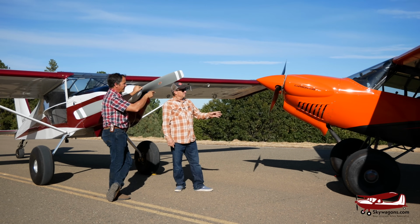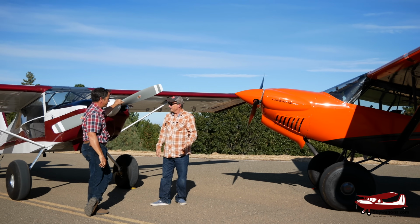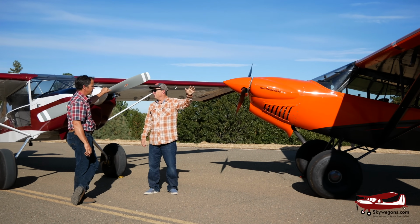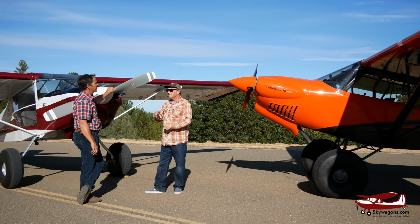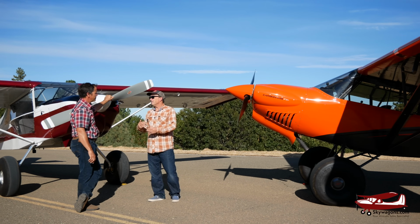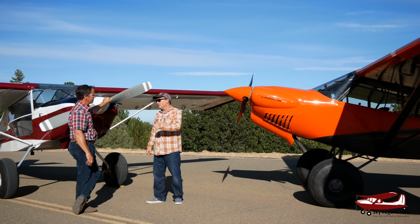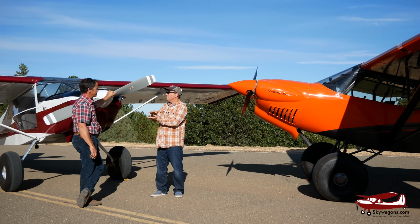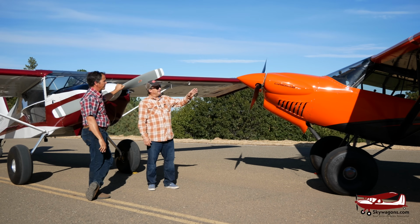Fabric, carbon fiber. Now this FX3, you go to the factory a couple of times and you help them. You're there day one when the customer cuts the fabric and the carbon fiber. You're there the whole week going from station to station, cutting metal tubes, basically cutting your airplane serial number. Wow. Then you leave, they do a bunch of work, and you come back 5 or 6 weeks later. Then you start putting things together. I dimpled every single rivet. Installed the rivets, did the press. It's got metal control surfaces. They did the real fine work, the painting, the rib stitching.